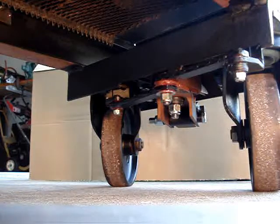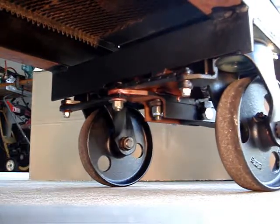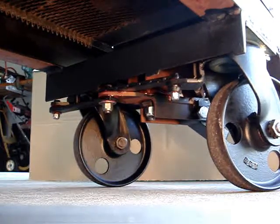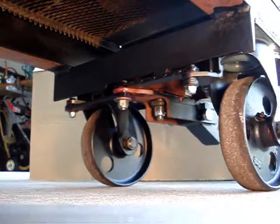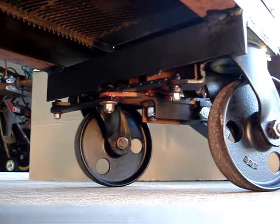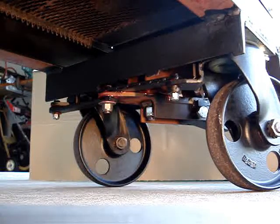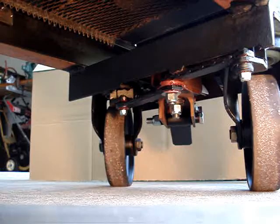This is how the casters steer. I got the back wheels in shot — apparently they want to move. But this is the linkage. I got two separate steering bars under there, and they only go over about 45 degrees — maybe not even 45 degrees each way, for unknown reasons. I can't get them to go any further. Actually I have spring-loaded stops in there to keep them from going further, because once they go past about 40 degrees either way, they tend to lock up and bind solid.